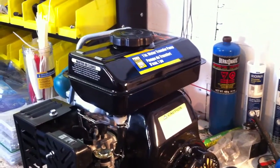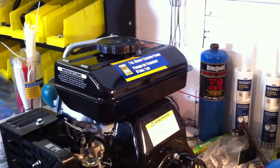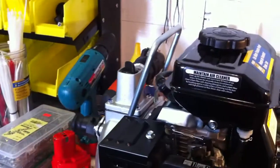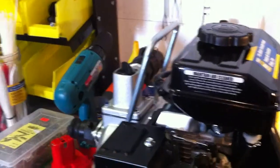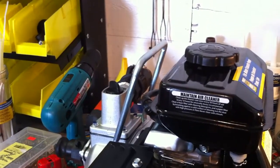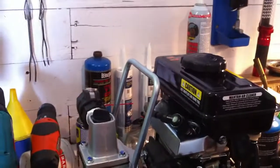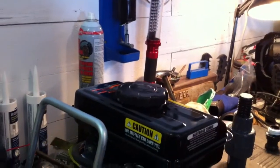There's a lot of misconceptions about these pumps. They always say that they're self-priming and this and that, and all you have to do is fill the pump casing with water to get them to start pumping. These are centrifugal pumps. They cannot pump air, so they have difficulty priming themselves. What you have to do is fill your suction line from the bottom to the casing, right to the top here, pretty much with water.